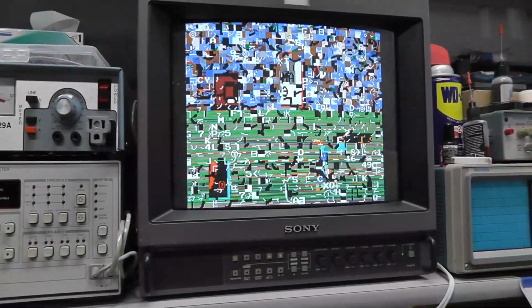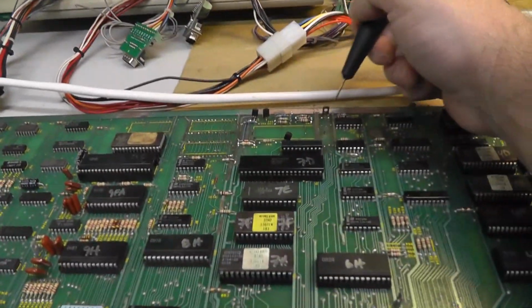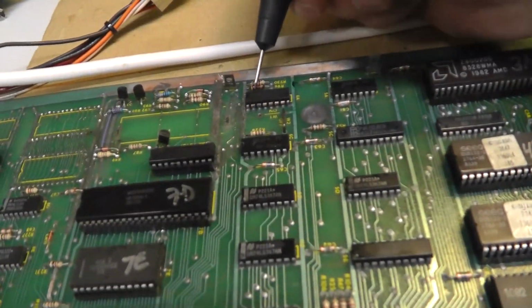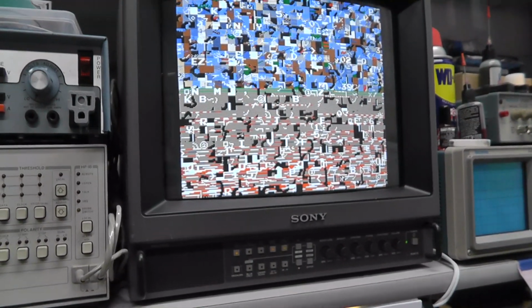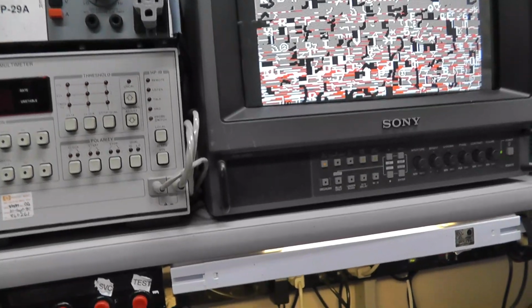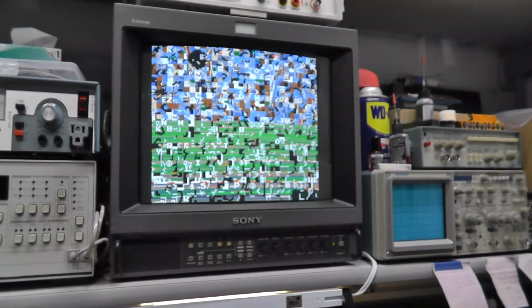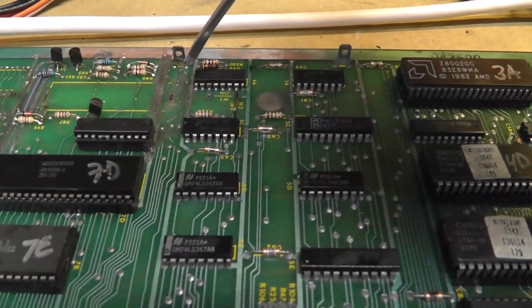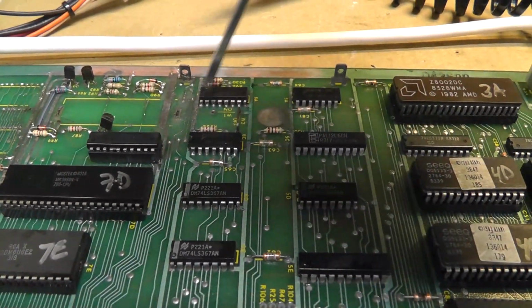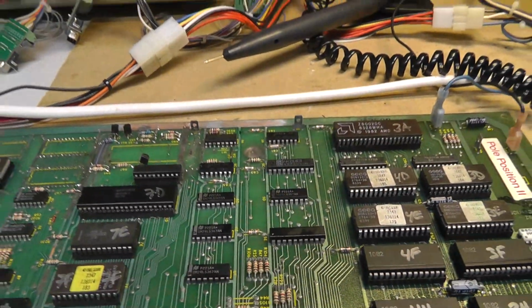See, and I just got it to reset just by pressing on that chip a little bit. Now it did reboot. Pin 15 is the carryout, which is low. See, I just got it to reset again, and it's frozen. There's something going on with that chip 6A, and I just reset it, and it was questionable anyway. I could tell that's the one where you can see maybe that the legs, after I did the acid bath wash, like the tin is completely off. I bet this chip is bad.